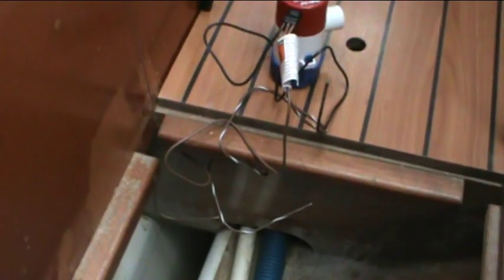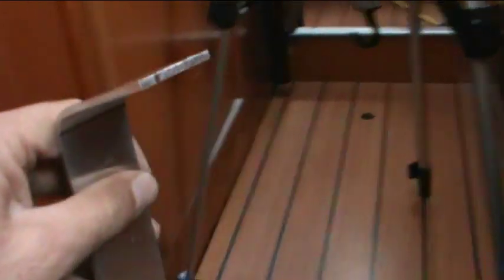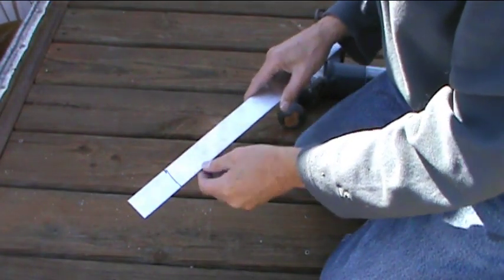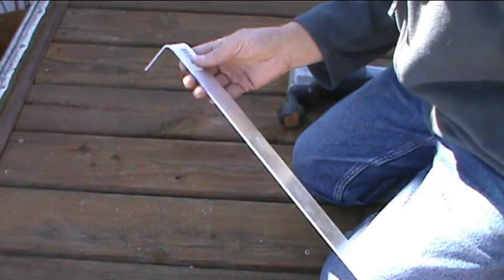As you can see, we have a fairly narrow keel sump in this bilge and it's going to be rather difficult to get down there and screw the pump down. So what I've done is I've got this piece of aluminum flat bar and I've bent a flat on one end that the pump will sit on, and I will drill and tap that for the pump. Then up at this end, I've bent it so that it'll sit and I can screw it on the edge of the keel. I've dropped this into the bilge and marked the height to where the turn of the keel is.